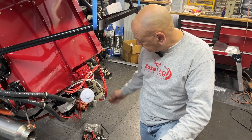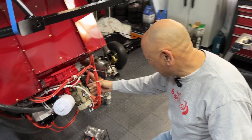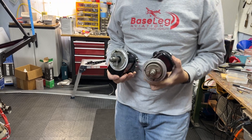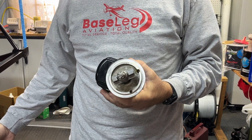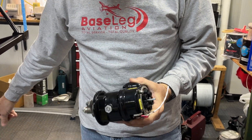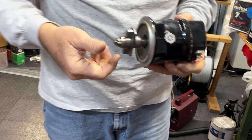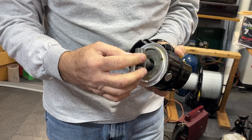That's a Lycoming-trademarked electronic ignition system — basically a SureFly. It has a wire direct to the battery so it's always hot, and uses a standard P-lead to ground and unground it for starting — making starting much easier with a much hotter spark. It's a direct-drive magneto. There's an accessory gear in the accessory case driving both magnetos. On a six-cylinder engine, instead of a gear there's a different housing with rubber cushions to handle different vibration modes — that's a direct-drive magneto versus an impulse-coupled magneto.